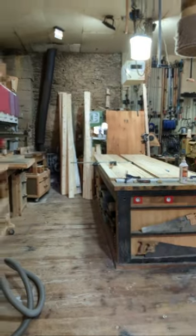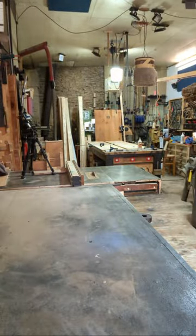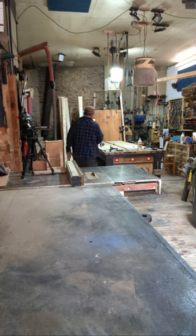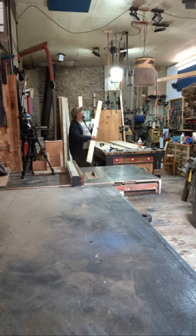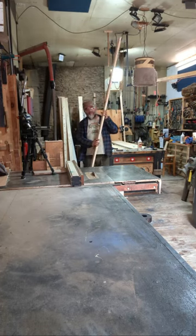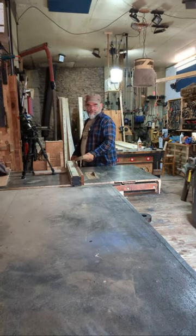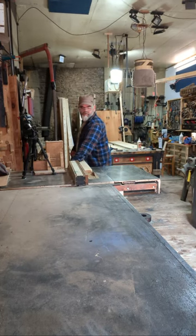Now, luckily, we don't have that filing cabinet in the way now, so we moved it. It was on the end of this bench. That was a stupid place to put it. So anyway, let's rip these 2 boards down, take the tongues off, and that way we can bring the 2 shutters together, and I won't make a stupid mistake and end up not allowing for the groove.